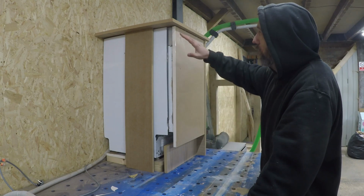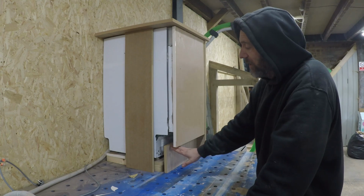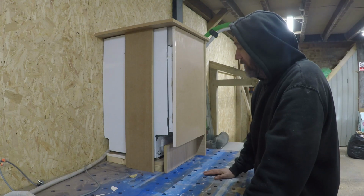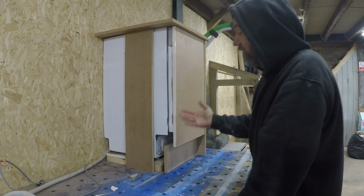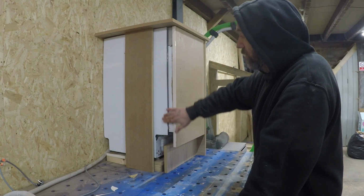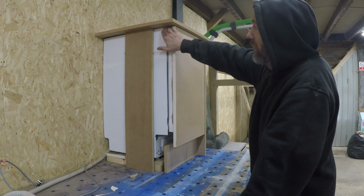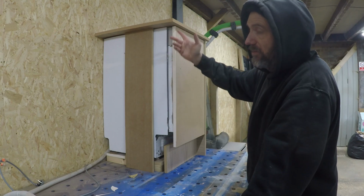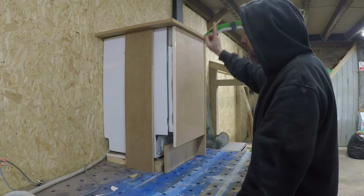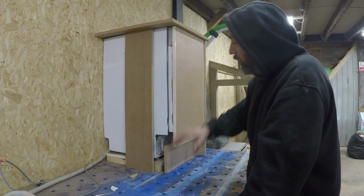So you've got your 900 worktop, your 720 cabinet door, and then you end up with a 150, 160 plinth out of the box. The standard rule used to be, when I first started fitting kitchens, that dishwashers were fitted up to the underside of the worktop with some brackets, because nine times out of ten years ago it was all laminate worktop, and you screw up into the worktop, through the side of the dishwasher. Then you put your plinth on.